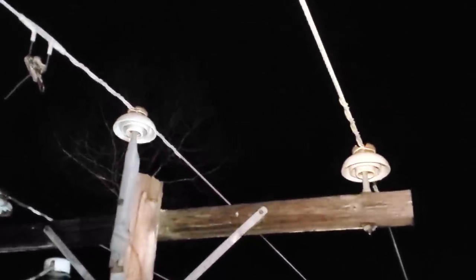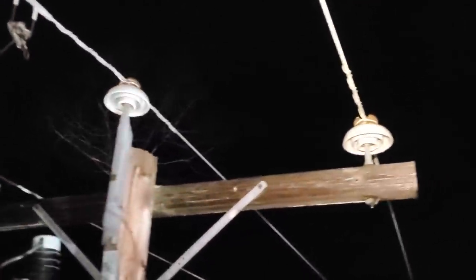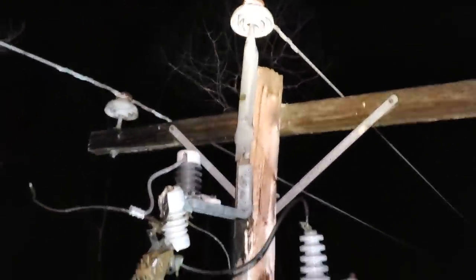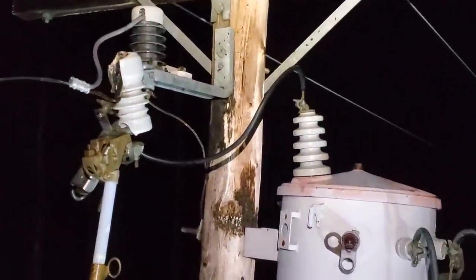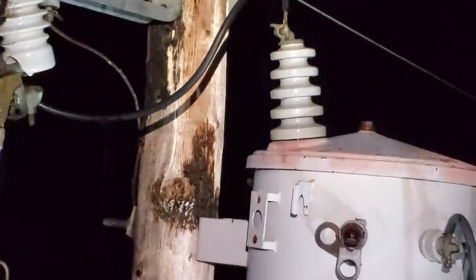Also you want to make sure none of your insulators are cracked, leaking or broken. A quick visual inspection usually is enough, but something that will indicate a leaking insulator pretty quick — and I've shown this in a few videos now — is that fractal wood burning in the pole.